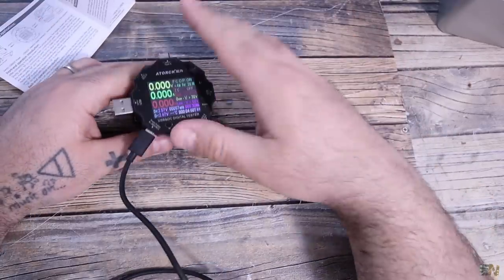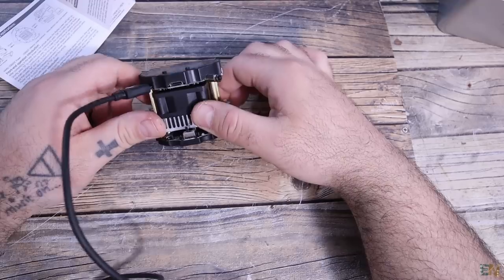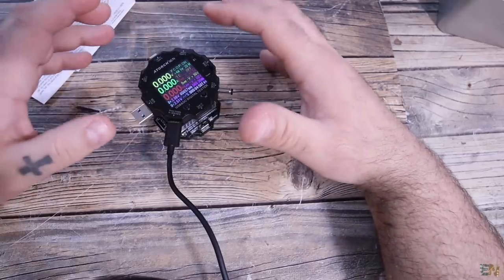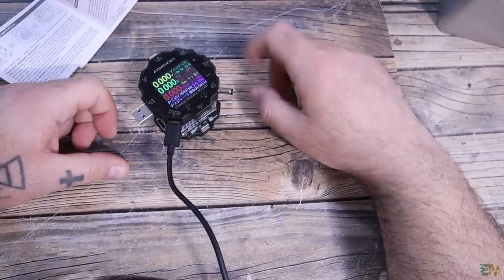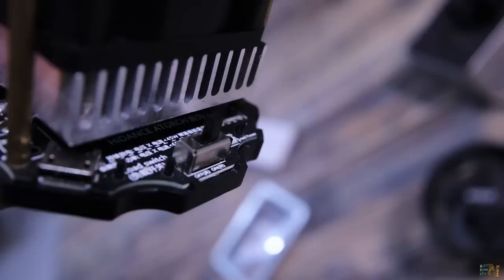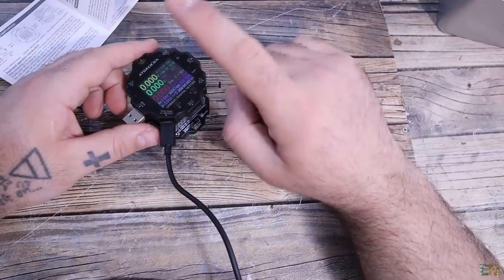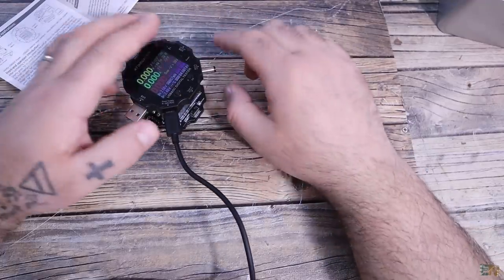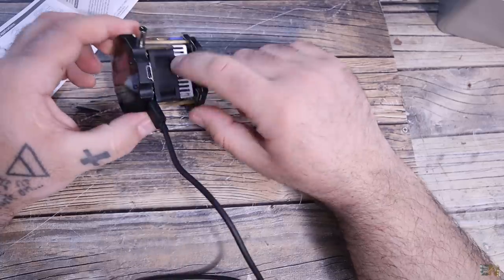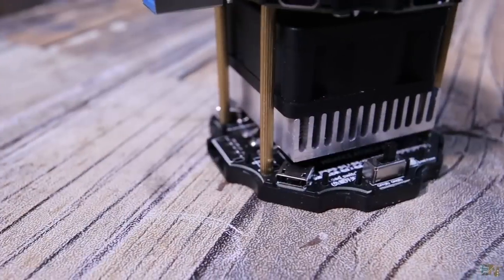So basically, I will use this to measure the power for a power supply that I'm creating based on the STM32, and I will use this to apply different loads, and like that I can really test my power supply. You can also use this with motors, with inverters, and so on. And I'm also planning on making such a resistive load, because the digital part is very easy, just a screen and an input, and the difficult part will be to control the load here. And just making two PCBs like this one with a heat dissipator should be very easy. We order the PCB at PCBWay and mount it up.